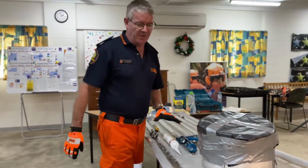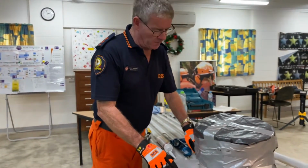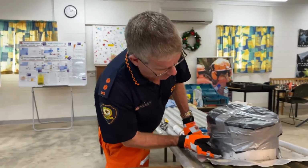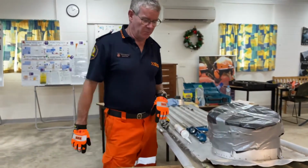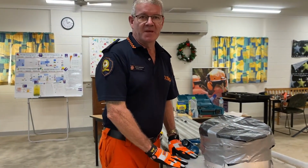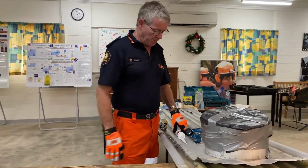So that one we're going to fix up. Okay, so we've got these two, the little head of the screw here, and that one as well. We keep looking around, there's not much else that we can see that's leaking. Everything looks okay at this stage. So what we would do is try to seal those two. Now, if our roof's dry, silicone's great. If it's pouring rain and we're having a bit of trouble, we have to make sure it's dry before we put our silicone on.